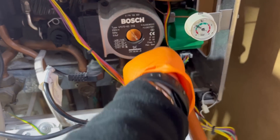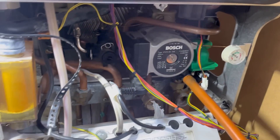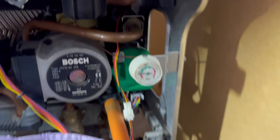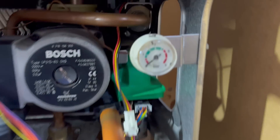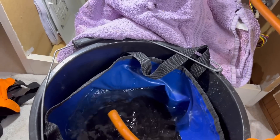I'm going to drain the boiler off using the internal drain point. I'm going to recharge the expansion vessel, which is at the back here, just to try and clear any water out of the boiler before taking the round block out, otherwise we'll be constantly getting wet. Pressure's back to zero - that's recharged to one bar. Happy days.